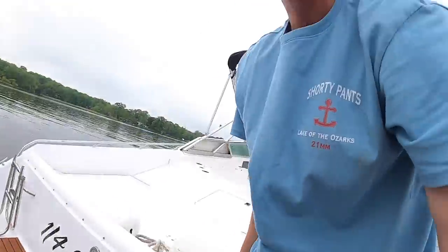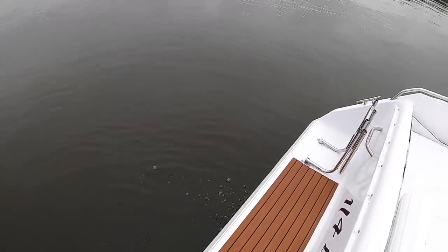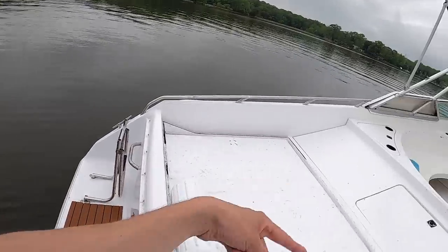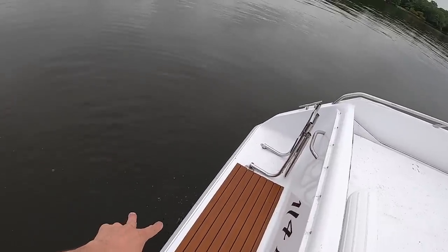That's a reminder. Twin 454, 7.4 liter big block Chevy, General Motors. Mercruiser calls them 7.4 liter Mercruiser MPI. They make 310 horsepower apiece, and they're paired to two Bravo 3 Gen 1 stern drives, one of which I have entirely rebuilt because the upper end blew up last summer. 2-to-1 ratio, so every two revolutions of the engines, one revolution of the props, running twin 28 pitch, three blades that are counter-rotating on each stern drive.